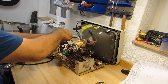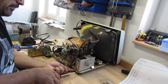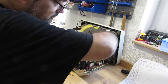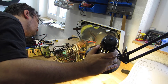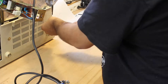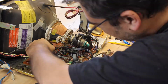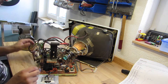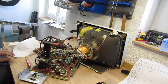I will then continue to remove the neckboard so I can later slide down the mainboard. The latter is secured by many screws. But even after I had removed all of them — or so I believed — the mainboard is still stuck and will only move a bit. I eventually glimpsed at something which I thought was yet another screw, though to get access I had to unlock the entire retainer rail. After removing some of the wiring, I could finally slide away the mainboard far enough to access that hidden screw — secured by some hot melt glue. I will use a heat gun to dissipate it, and only then can I unfasten that screw.